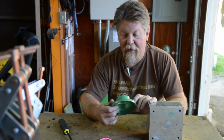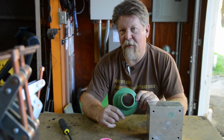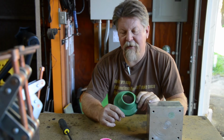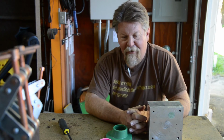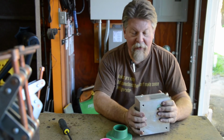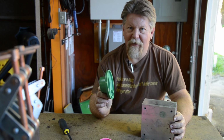Need to play around with some of the temperatures, maybe the wax injection temperature, the mold temperature, just to make this more efficient and work better so the waxes don't have any problems. But we'll save that for a different video. In the end, here it is, in wonderful aluminum glory, my new mold for the stainless steel Oona back. So we'll see you on the next video.